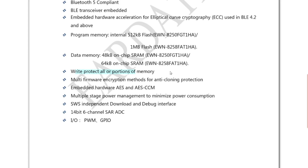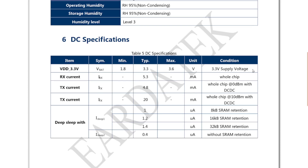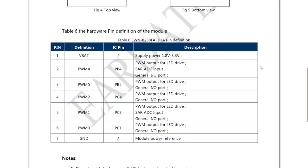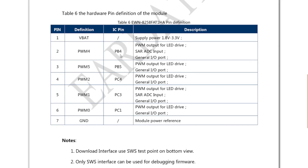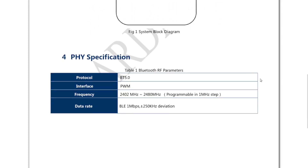Protectable memory — so even if I knew how to get the memory out of this thing, I wouldn't be able to. It runs on 3.3 volts, so maybe I misunderstood that regulator, or maybe there's something else happening to drop the voltage down for this chip. It has seven pins: power, ground, and five GPIO pins. All of them are capable of PWM, and two of them are ADC inputs. I guess that chip is more than capable of handling just such a light load. Out of those five GPIOs, it's probably using three of them: one for that push button, one for this push button, and one for the relay output.